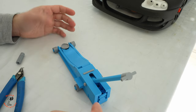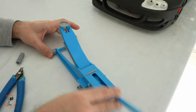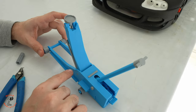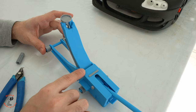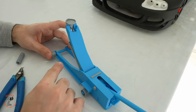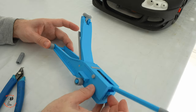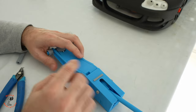It's done. So when you want to jack up the car, you do like this — it will engage the latch, then it will jack it up. When it comes to the end, you can jack up a bit more but it will disengage the gear so it doesn't break the gear — that's how I designed it. And when you want to bring it down, you just release the latch from here and it will disengage the gears and it will come down.